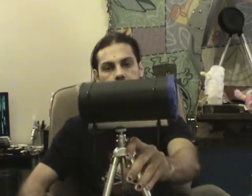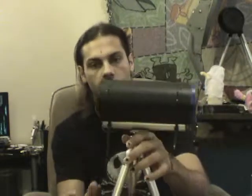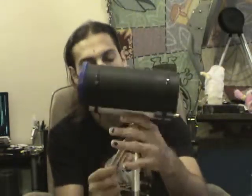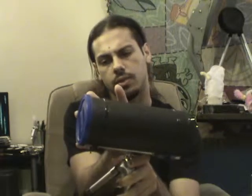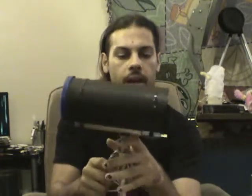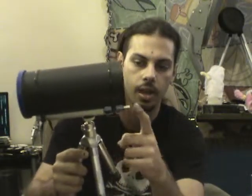Now, here is my Bluetooth waveguide. It is one sexy bitch. Some of you may have seen this already on my Picasa page. This is a 3.5 inch diameter metal can at I think 7.5 or 8 inches long, so about 9 inches long. And I haven't used any coax connectors. I directly soldered a piece of coax right into the can. That's something that I want to cover today.